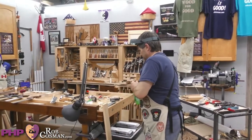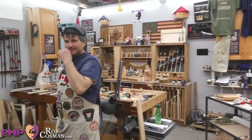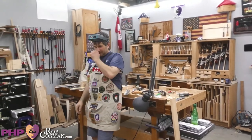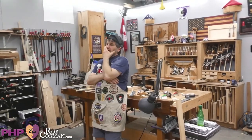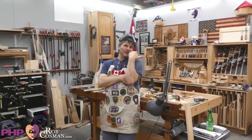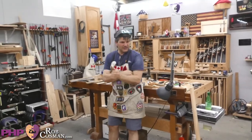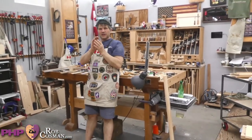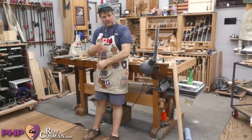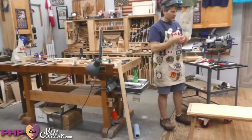Barry Doxy in South Benfleet, Essex, United Kingdom asks, how do you create an even fine set on fine teeth? I've not found a saw set that does this well. Yeah, so that's the problem. Like I said, when I set my teeth with that one, I have to go back in and stone them, because nobody seems to make one that has an anvil that is small enough. Now, we're back talking about the same topic again.